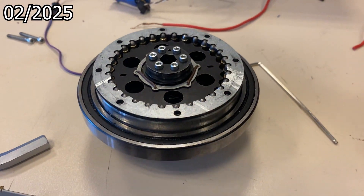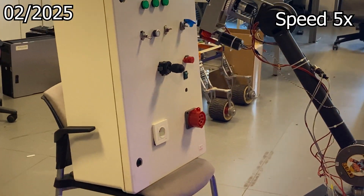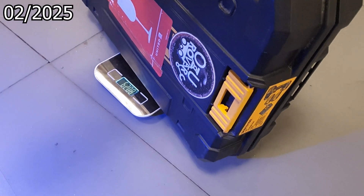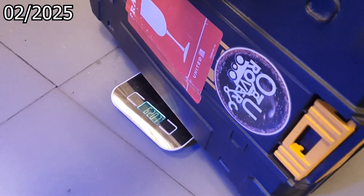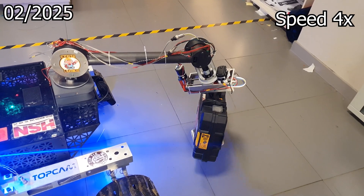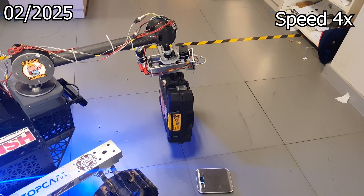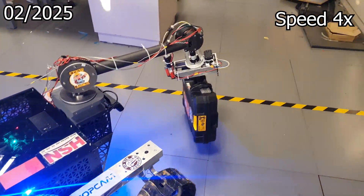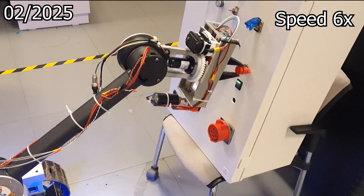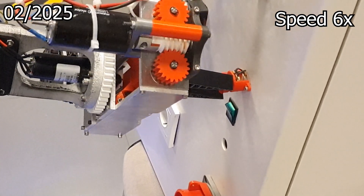For the manipulator, we retained the carbon fiber tube links and 3D-printed carbon fiber reinforced joints to maintain a lightweight yet strong structure. The cycloidal drives were completely redesigned and manufactured for enhanced reliability and load capacity. The end effector features a gripper with TPU jaws, providing better flexibility and grip while handling objects. The linear movement mechanism adapts for precise control, while the worm gear system ensures non-backdrive reliability and increases torque, enhancing the force applied. The end effector also has a slip ring mechanism, which enables infinite rotation for ease of use.